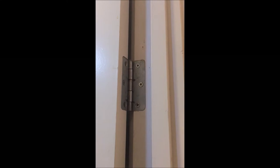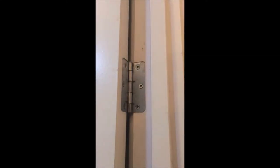Before drilling the 22mm hole, we're doing this in place, which you can do in most places. Here with our cut-outs I can put it through into the wall, or you have a choice — you can put it into the door with a push plate on the jamb.